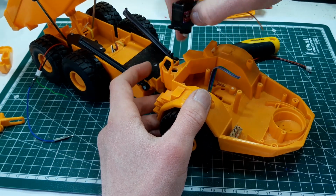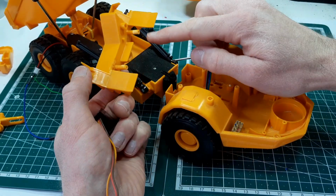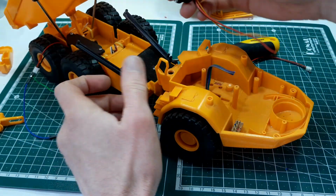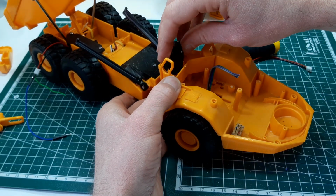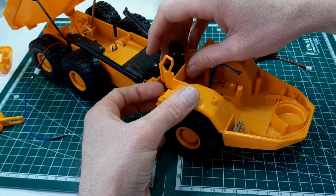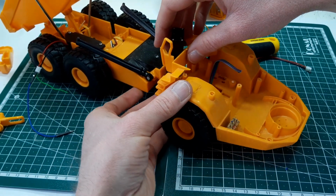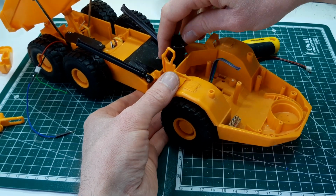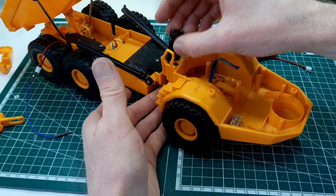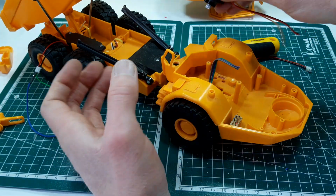get the threads lined up between the servo and the servo arm, and then screw it tightly together with the 2 mounting points here and here. So that's those 2 points there, and that would mean that we'd have full control of our joint here in the center, and we'd be able to adjust the position with just those 2 screws. Just take them off, twist our front section slightly if we need to, and remount the servo, getting the threads lined up again, so that we'll say our 90 degree point on our servo is straightforward, or as close to straightforward as we can.